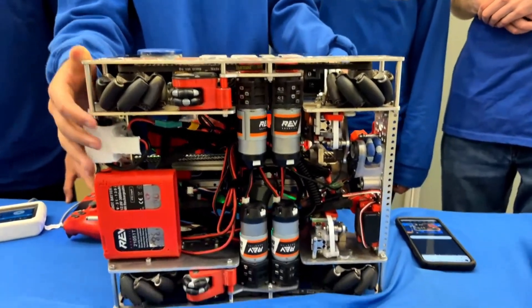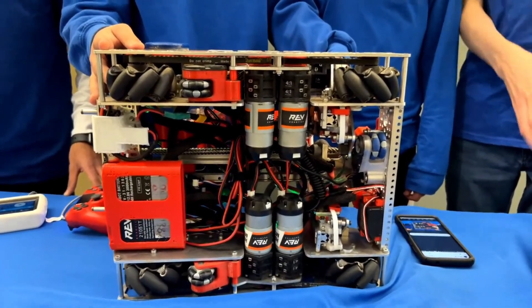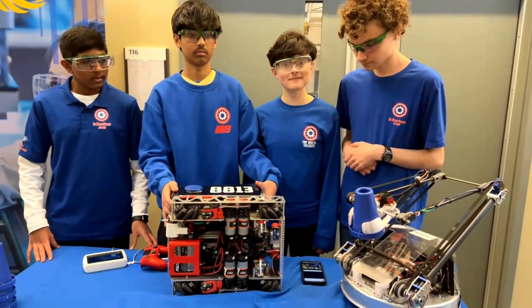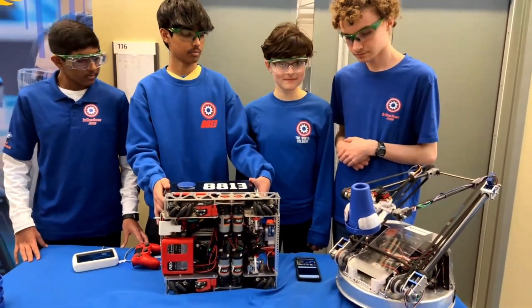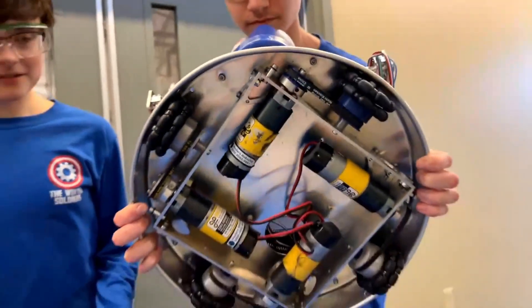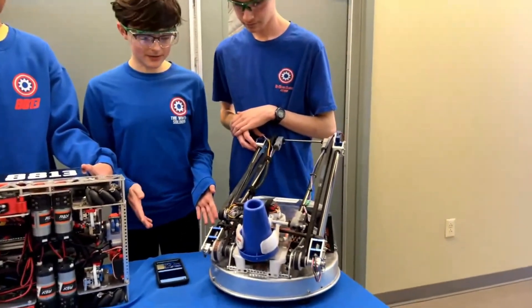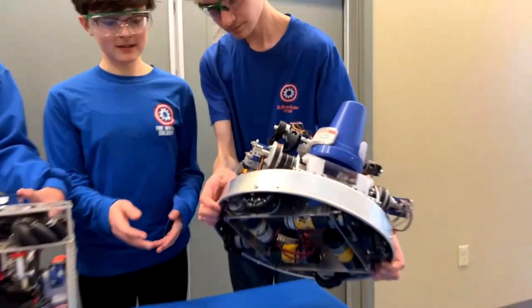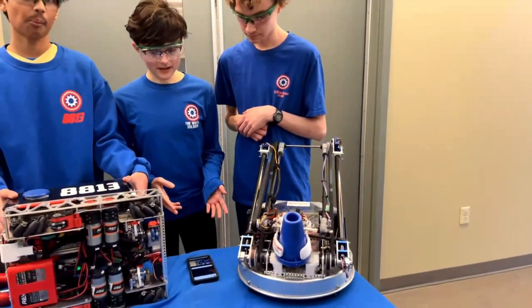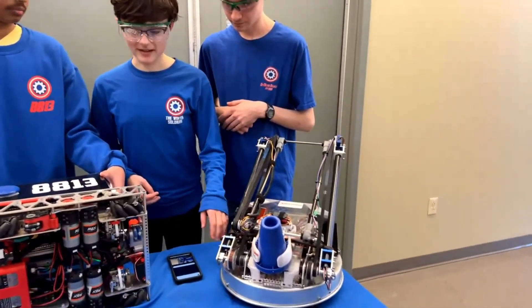This whole robot just screams compactness. This is obviously your second generation robot — we can see the old one on the side of the table. When going from that design to here, what packaging challenges did you have moving from that circular drivetrain to this more traditional parallel plate style? Our original chassis was set up as an X-drive. We wanted it to be round so it wouldn't get hooked on the poles, so we made it into a cake pan shape. The challenge was that our odometry pods didn't have enough vertical space inside to retract and go over ground junctions without getting stuck.